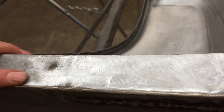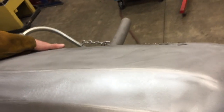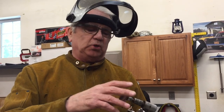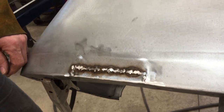Lots of sanding, lots of grinding. Here's the top and as you can see it looks like it's never been touched before. I got it all filled in on this side and now I just have to grind it. I did want to mention that when you're grinding, don't cheap out on the discs. You need a nice fresh cutting disc that's really sharp, because if the sanding disc is worn you're going to put too much pressure, put heat into the panel, and warp the panel. Get a few extra sanding discs, keep swapping them out — it'll grind faster and you won't have any panel warping issues.